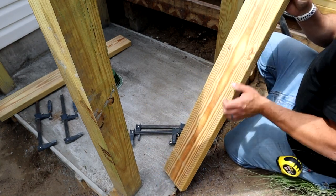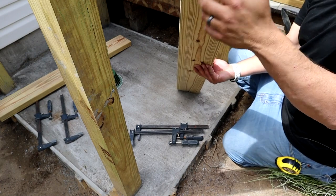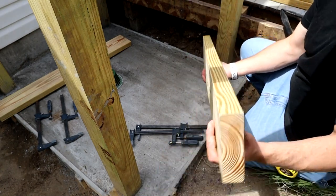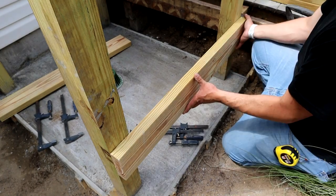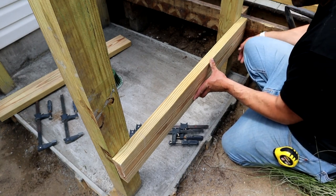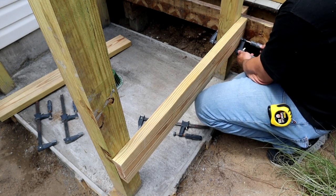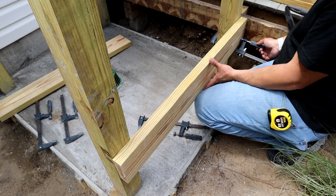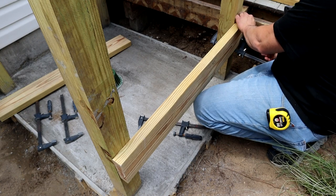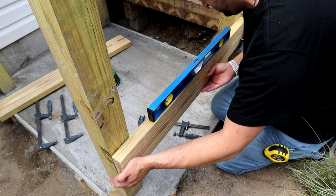To attach these, you want to take a look at the crown on the wood. You see how it's cupped like a half moon - you want to put it so the inside of that cup is up against the posts. I set my height on this end and make sure the top of this is flush. You're never concerned about the bottom when building a deck, you just want the top to be flush. I'll take some clamps and clamp it in place so I know exactly where I need to be when putting the fasteners in.